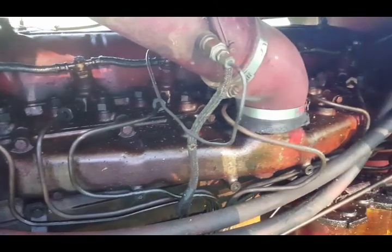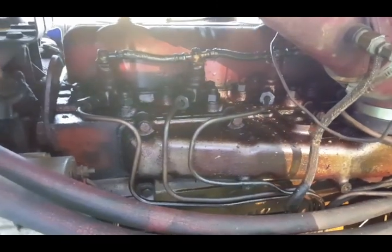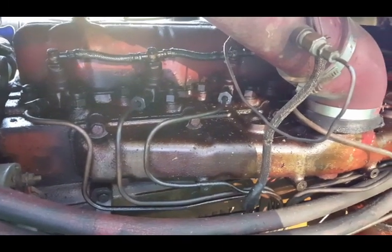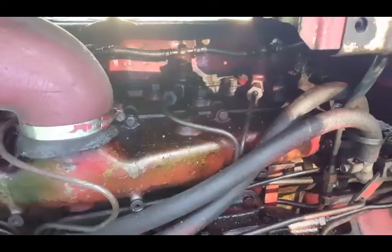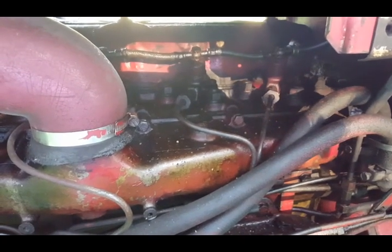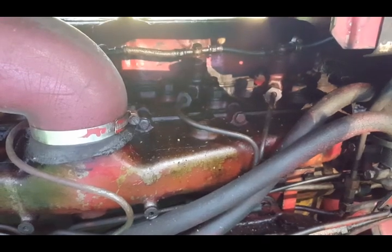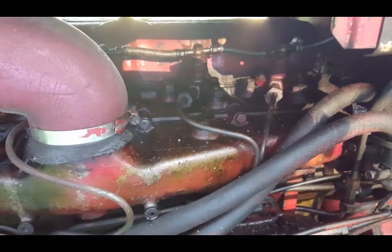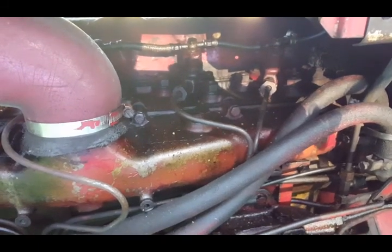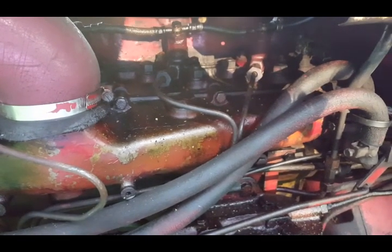And this is the second time I tried tightening a little bit, and both times it made the engine run a little bit worse. I don't know. I guess I thought I was injecting too soon and it wasn't burning well. So I tightened it to try to make it inject later. But if it's injecting too late, I could have the same problem.